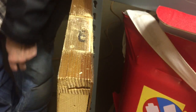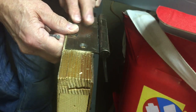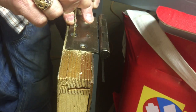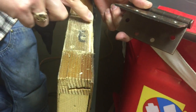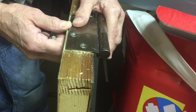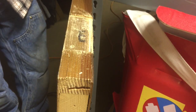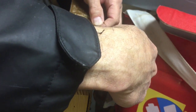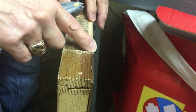Hold your hinge up there, mark your holes, and then drill in the very center of each one. Run your screws in. If you were able to save this piece you could put it back over here, otherwise you could glue that piece back in. Now with a wood chisel and a razor knife, you would take your razor knife and score this — the reason you score that before you cut it is so that the wood doesn't splinter out.